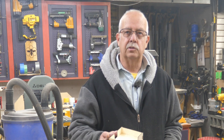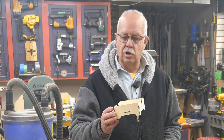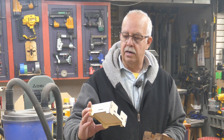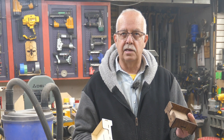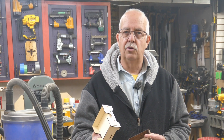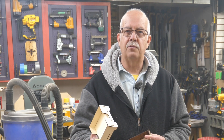You'll need to glue it together because it will fall apart if bumped. The two-millimeter version fits together a little tighter than the three-millimeter, though that may vary with the specific plywood. You can finish it any way you like — this one is stained with walnut stain, no polyurethane or polycrylic yet. You could also paint it, or leave it natural with just a clear coat. Do put some kind of coating on it to guard against soiling, moisture from wet fingers, and so on.